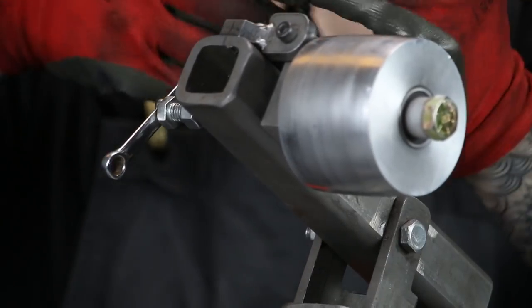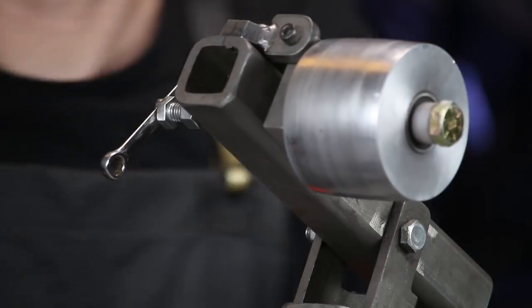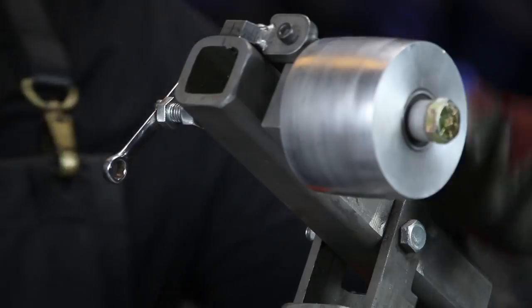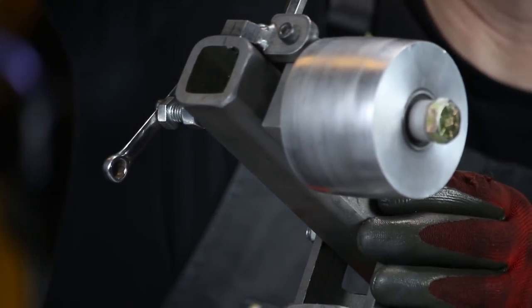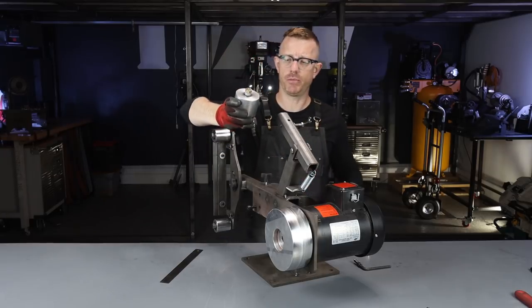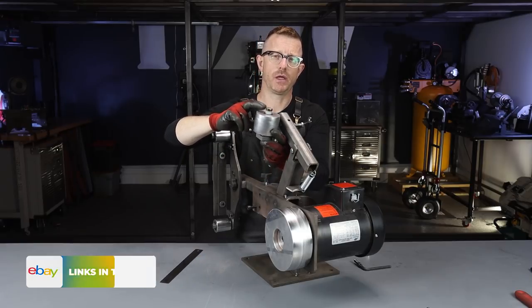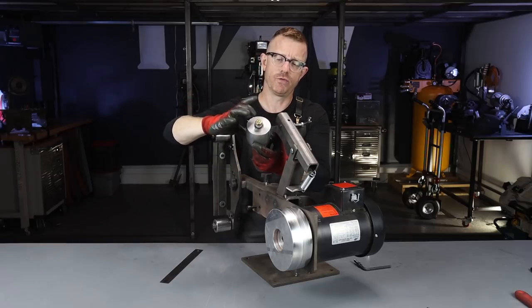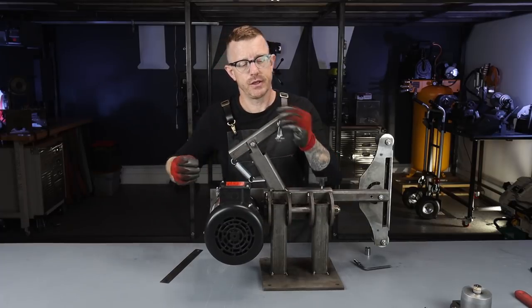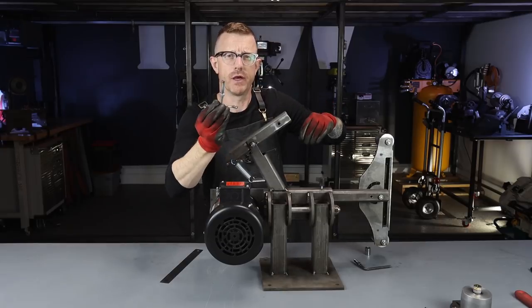Let me show you how simple it is to attach this and lock it into place. This gives you the fine tuning you really want with a floating tracking mechanism. I made a small notch mark on the front of the steel so I can line it all back up, because just a minute adjustment to this really does make an enormous difference. When you buy this particular tracking wheel from Origin Blade Makers on eBay — I'll include links in the description — it comes pretty much assembled just like this. I did modify it with a small half-inch nylon spacer just to move the wheel on the axle a little bit. It's basically a turnkey installation. I like that if you use all three-eighths inch 16 bolts, you really only need one tap to make all this work.